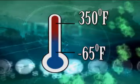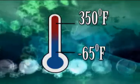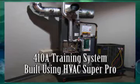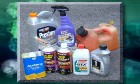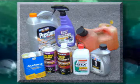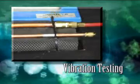Super Pro has a temperature range of -65 degrees to 350 degrees Fahrenheit, which far exceeds the exhaust temperature of a 410A system. The 350-degree constant temperature range makes HVAC Super Pro ideal for all types of hydronic heating systems, including boilers and baseboard heaters. HVAC Super Pro is impervious to fuels, solvents, bases to pH 12, acids, and glycol. Super Pro has been tested at accelerated vibration levels to simulate the vibration of HVAC and refrigeration systems.